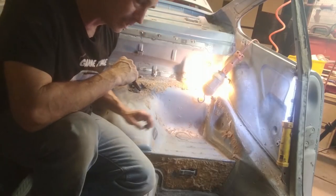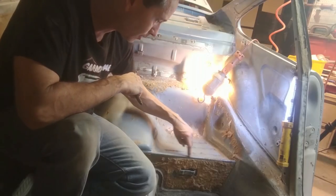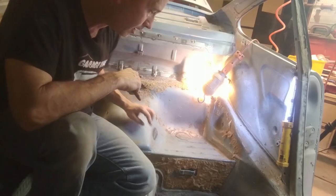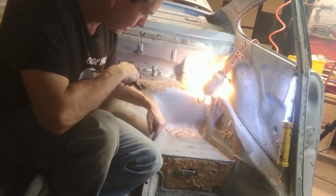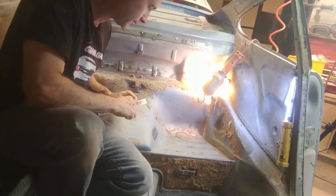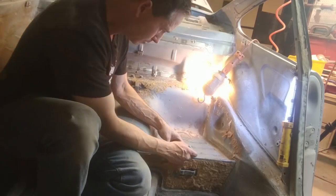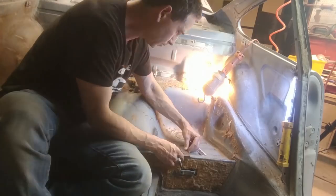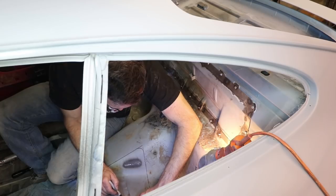What makes the most sense from a welding point of view is to cut along the strongest areas. This edge right here is very, very strong, so when I go back to weld it, it will not distort. And then this edge right here is also strong. So I'm just going to trace it with my Sharpie. I like to round the corners so that the metal doesn't just dive or shrink in when I weld it.